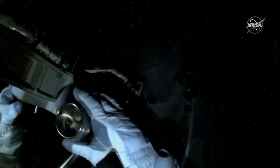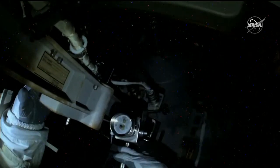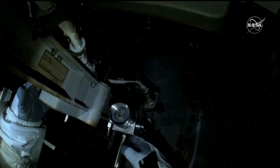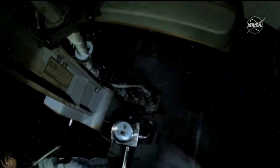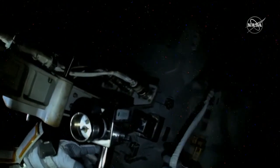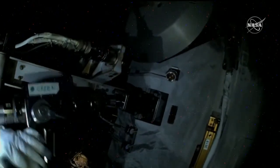And your lead torque is broken one turn. I just want to confirm I was fully seated on the bolt. A little hard to tell because it's in the stanchion out pretty deep there. Checking the PGT steps. Yep, and torque is broken, Drew. Copy that, Kayla. I was on it originally. Yeah, Kayla, if you had experienced any running torque at all, we expected that you broke torque if you're experiencing some running torque. And I'll just stand by for Tom to continue turning. Copy that.